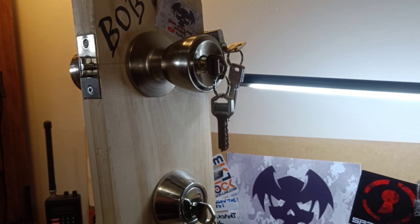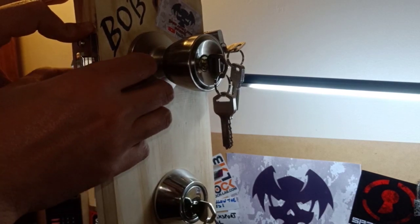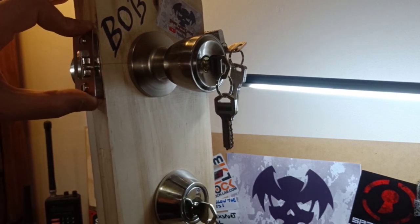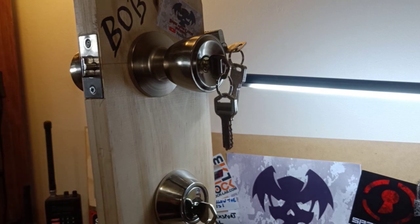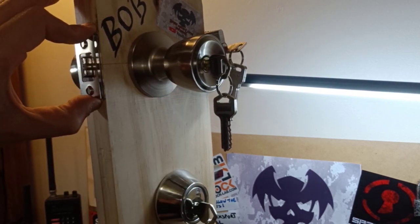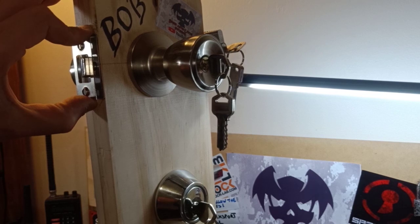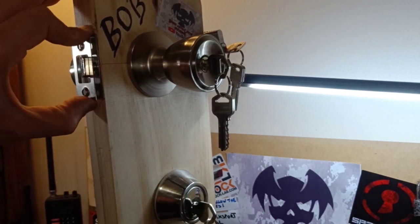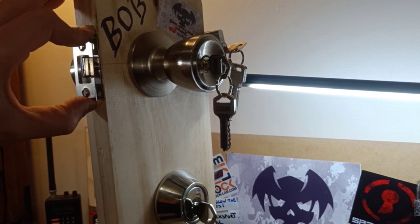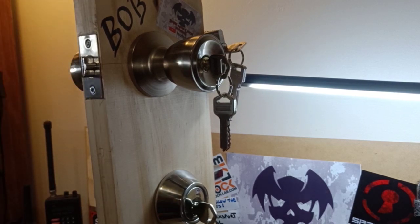So how can you do that? Well, the first method involves — like I can do with the back door of the house here — if I push in on the door into the door frame, I hear that sound. My old man was one of them — he'd always pull the door extra tight, give it a good hard pull when he was shutting it, because he believes that sound was actually the door locking. But instead he was actually freeing it up so that the latch could be slipped. So if they're installed correctly, that guard latch will actually be depressed in there so that the latch can't be pushed in. Either pushing or pulling on the door just that little bit will usually allow, if you've got enough movement in there, for it to fall in — then you can actually slip the latch using either a slim jim, a traveller hook, or the plastic shims for doors.